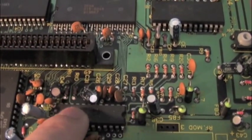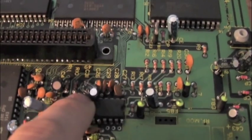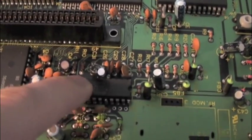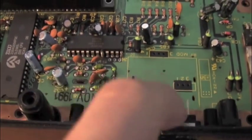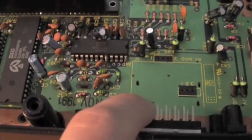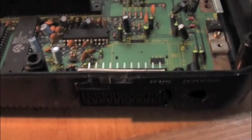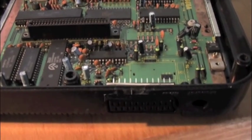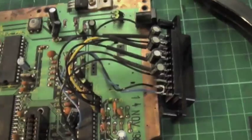I haven't decided yet. I'll try and see if I can get sound from here, just to keep the wiring neat, and I'll take the sound from pin 9 here and then string it across the 2 outputs here, so that all you need to do to make this work on any TV is you just need a SCART socket. Plug in SCART socket, switch on.